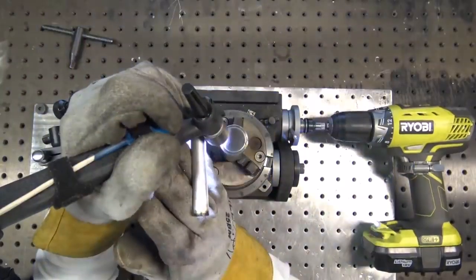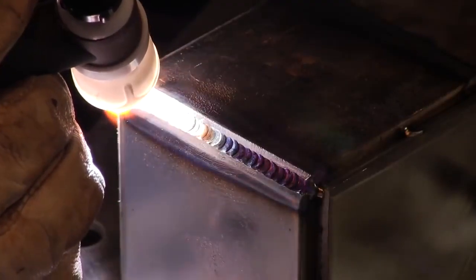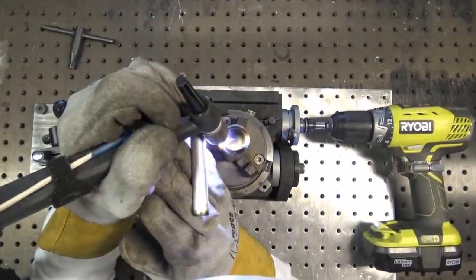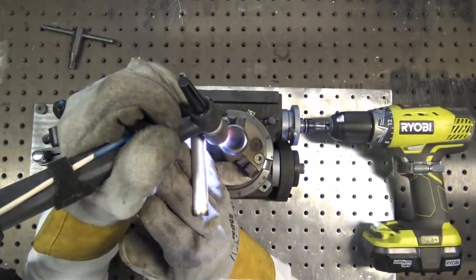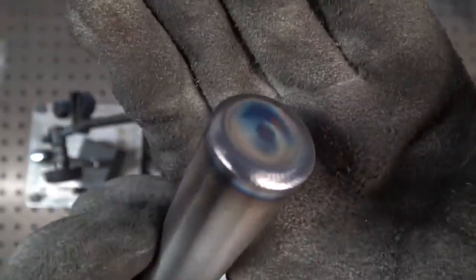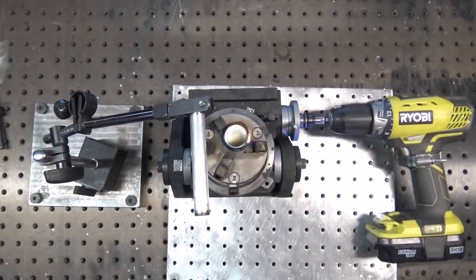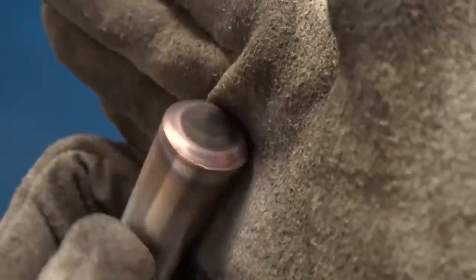The main tool is a tungsten electrode. It can be used to weld almost any metal or alloy, including low-carbon and high alloys. To ensure precision, the electrode is ground periodically. The equipment supplies an inert gas such as argon in a circumference. When air enters the welding area, hydrogen is released, resulting in a porous seam. Argon shields the welding area from the air, ensuring a high-quality weld.